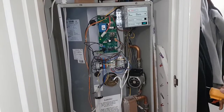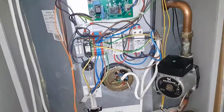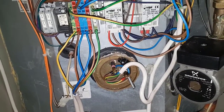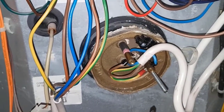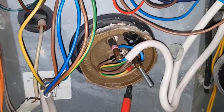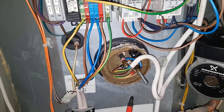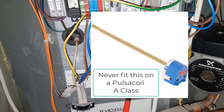There's another problem I'm going to talk about which was really disturbing. This boiler was blowing fuses - if you pass me a screwdriver I'll point out what happened. Somebody fitted a rod thermostat here - I'm not pointing to it directly because it's got live power at the moment. They connected the live and neutral wires from the immersion heater straight into a normal thermostat, so when the thermostat made contact it short-circuited and it banged.